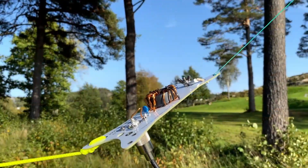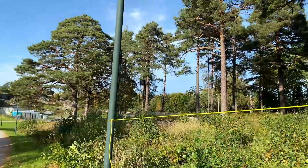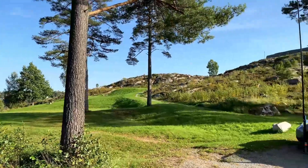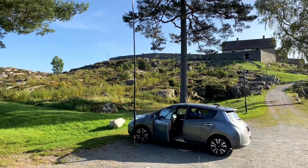You don't need a tuner if you make it right. I have several videos on different EFHW antennas. One of my favorites for portable use is the antenna you can see here — the RadioStuff.com EFHW half-wave kit. It's easy to build for a new ham, has great instructions, and is well-built, though it is a portable antenna. The great thing about end-fed antennas compared to dipoles and G5RVs is that they're easy to deploy: you can feed the antenna at ground level, put it up as an inverted V, and you only need one mast or tree to support it.